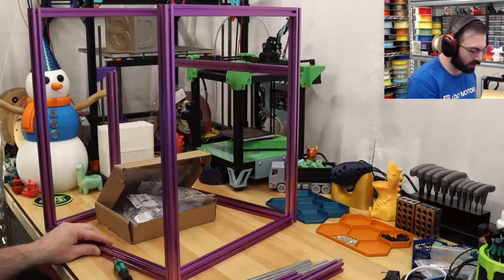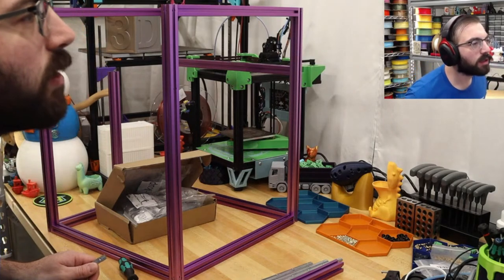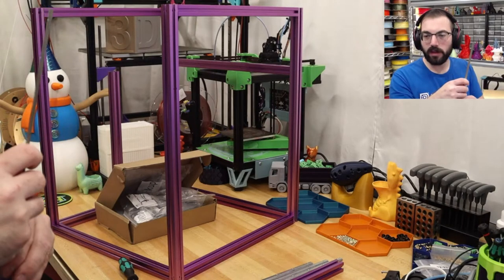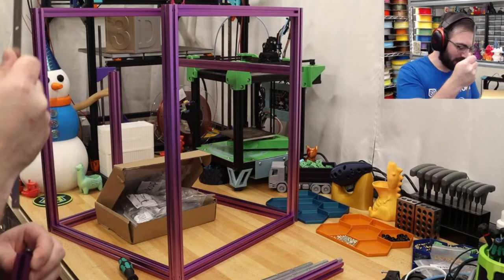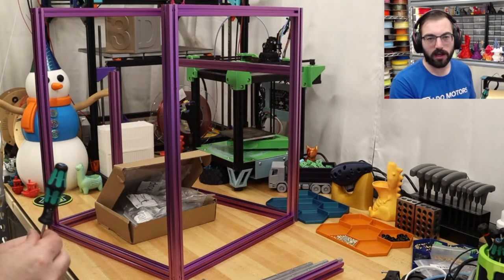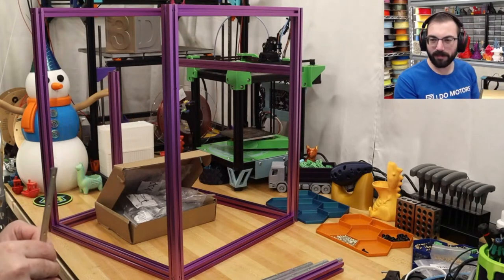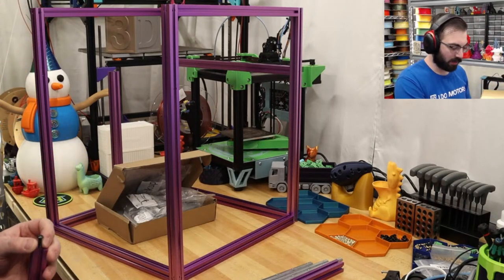Okay. Then two, we take our rail, and these are on the bottom. Right, the bottom of the y-axis. I believe this printer is the same thing as the 2.4 for the motion system. Yes, we need to get the correct distance for the y. Absolutely. It looks like we have to completely remove this screw anyway to get this on. So we can just use this bar right here to get the y correct. I'll take off the screws. Not that much of a setback, honestly, all things considered. That's like this. And then we can put this back on.